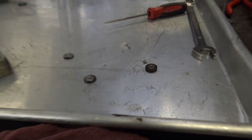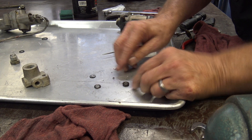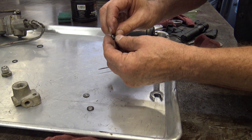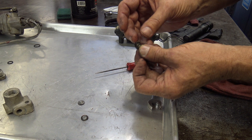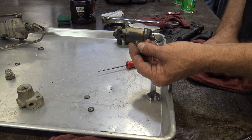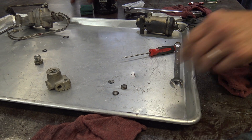So this restricts the amount of fluid through it. You can see there are small holes and the fluid has to go around this little piston in here. And when it was jammed, it won't even want to go this direction — it's not allowing fluid through. It's supposed to walk back and forth. So we're going to go ahead and clean that up right now.